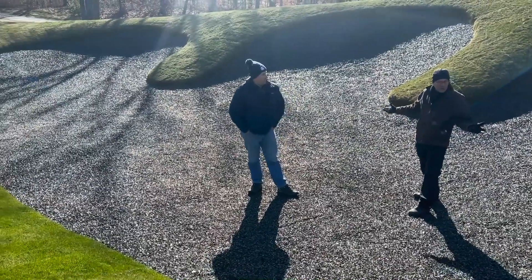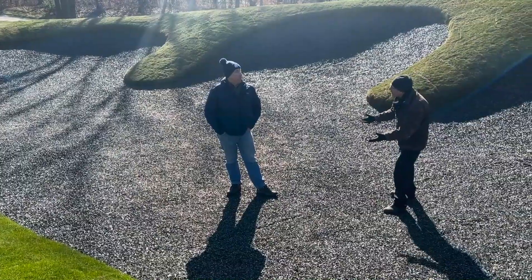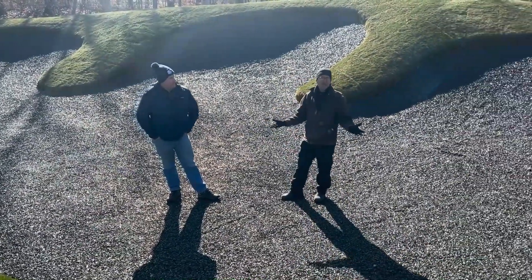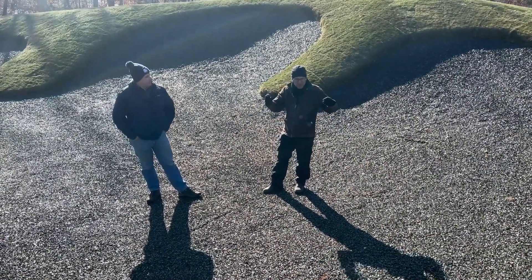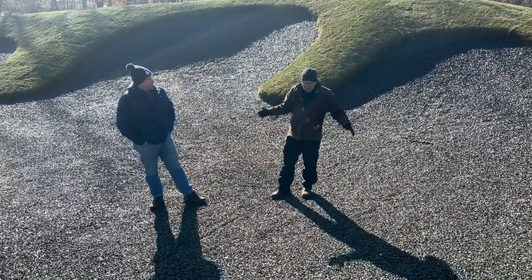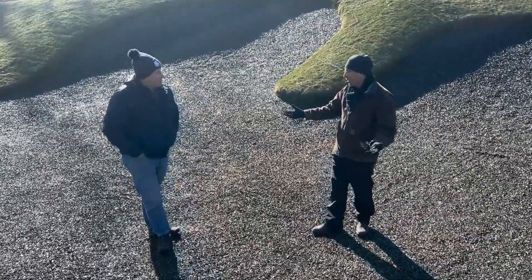What we would call it everywhere else is porous pavement; here they call it the Better Billy Bunker. It is essentially graded stone without the fines, sized so that they'll keep the voids open, and then they spray an epoxy on it. If someone's never seen it, this is a good video to see what's involved.